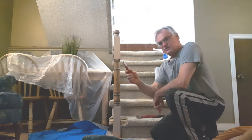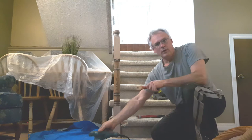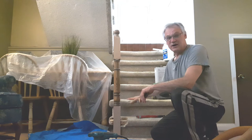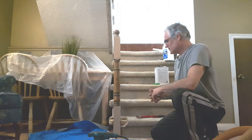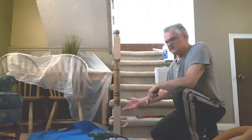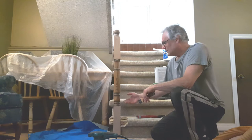The simplest way to get down into the tight areas is to use a scraper, because the palm sander can only get you to a certain point. You're going to need the scraper to get into the tight corners. You might be wondering why I'm doing this with the carpet — they're ditching this carpet, so it's going to be scrapped out. That's why I'm not really too concerned about what happens to it, because they're going to be doing the floors after I'm done the handrail. So we're doing the posts, the handrails, and the balusters. The balusters and the handrails I've got at my place, stripping them and refinishing them. The posts I left intact here — I find that removing the posts weakens them considerably, so it's just as easy to do them here. Applying the stain and finish is also easier when they're intact.